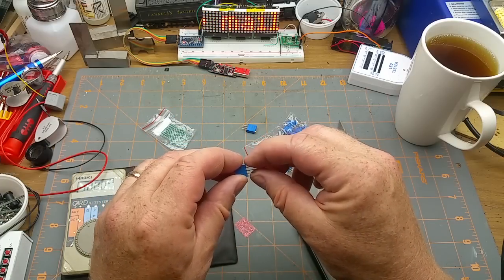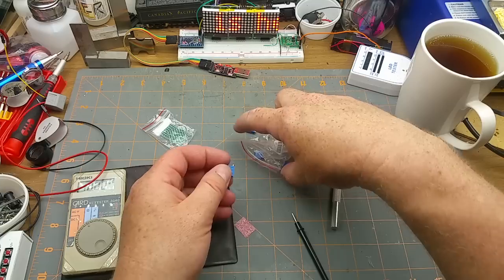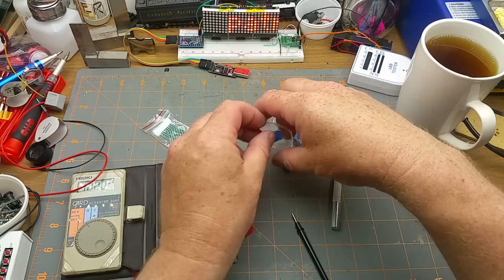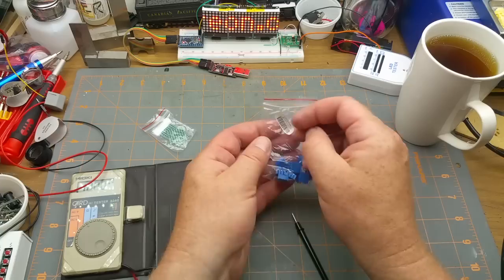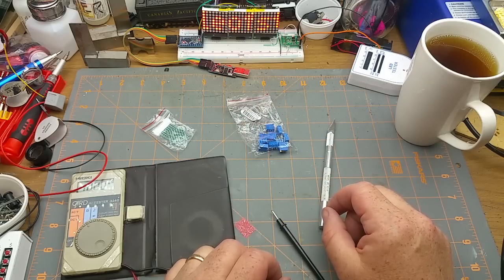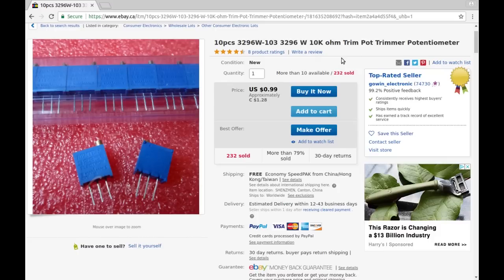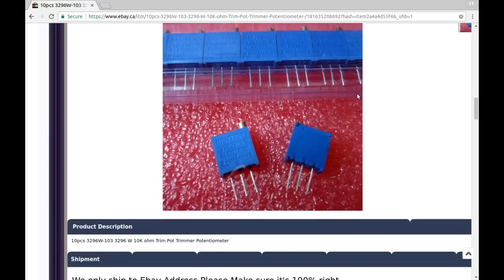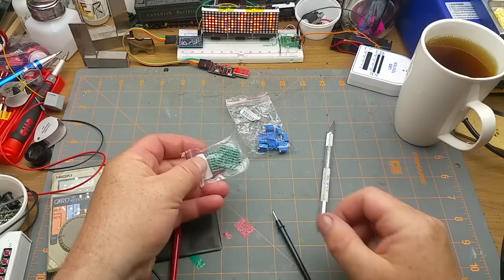They're probably going to be linear. There's the marking: W103, 10K. These are 10-turn 10K pots, so that'll let me get fairly fine precision. From the listing — 10K trim pot trimmer potentiometer from GoIn Electronic. I've bought from them many times. 10 of them for 99 American cents, or $1.28 Canadian. Those took about three months to get here.